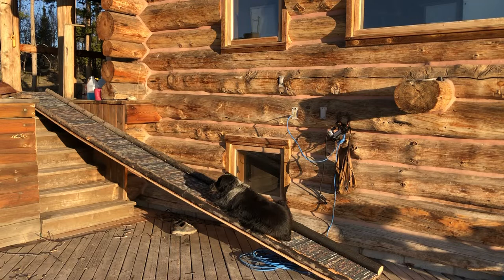I actually had the pieces around this place to make it, kind of as scrap, but really it was just one 4x8 sheet of plywood, 3/4 inch thick, and I ripped two lengthwise sections out of it that were 20 inches wide. I chose that intentionally to allow for some room in the staircase for somebody to pass if the ramp was down. I had these two lengthwise sections of 20 inches and I just laid those on the ground.